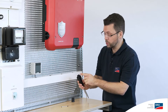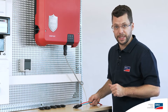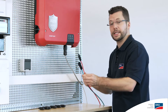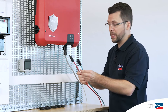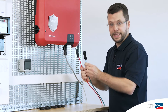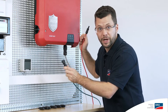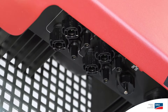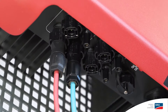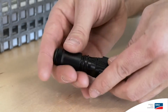When doing so, please ensure that the keyway is facing forward. Now for the cabling on the DC side. To do this, you'll need the PV array connection cable, to which the SunClix connectors and plugs have already been attached. Again, ensure that you connect the polarity of the cable correctly — negative and positive. Now, insert the cable in the corresponding connection areas, MPP Tracker A or MPP Tracker B. Cap the remaining connection sockets using the SunClix and filler plugs provided for this purpose.